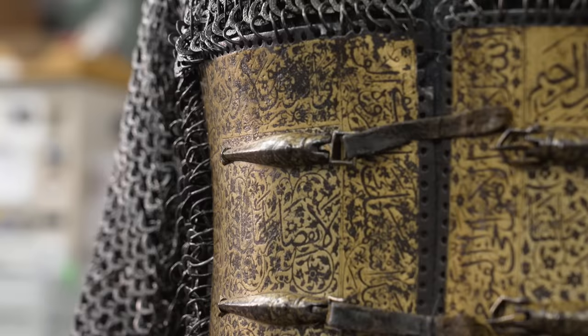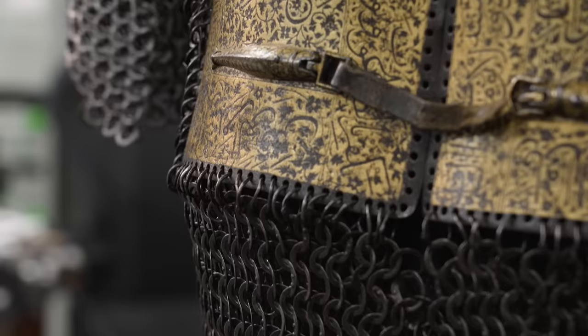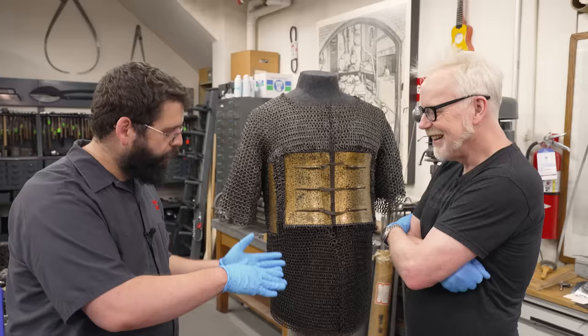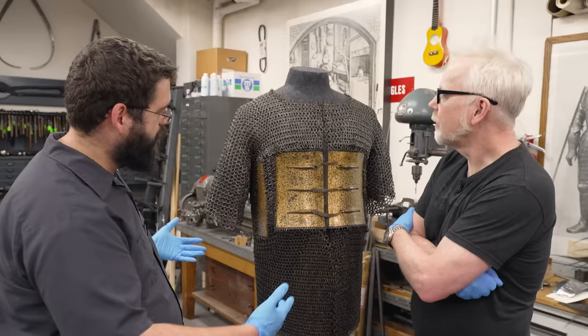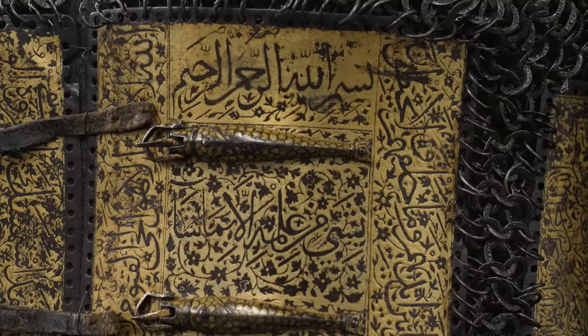And then that connects these just beautiful plates with Arabic inscription. There's sort of a two-tone of gold going on here — you'd lay the gold down and cut through it. And so my predecessor, Hermes Nauer, who was the armorer before Ted Hunter, spent literally months cleaning every single ring using a small wire brush. The cloud of orange would feed up through his air extractor as he was sitting here, working late into the night. Once he did the outside, he flipped it over and went to the inside. Between all the gold, he sat there with a needle and dental tools just picking away individual little bits of rust under a microscope, just to get down to this surface.